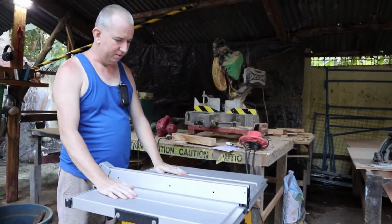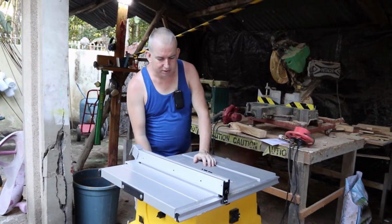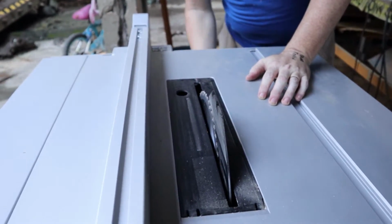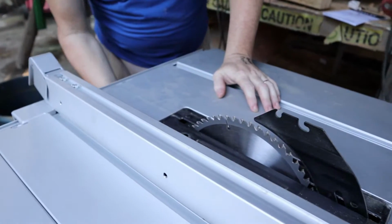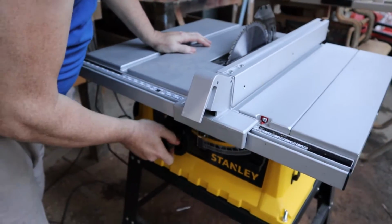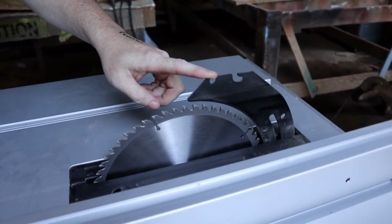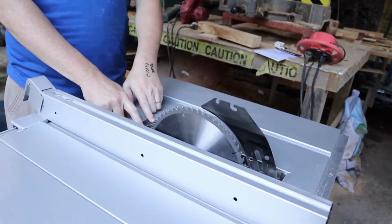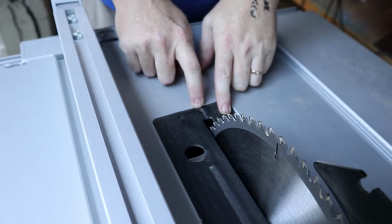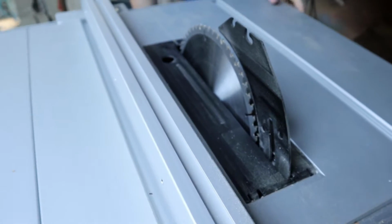This saw here has a nice flat bed. It's like it's made out of aluminum. The saw blade is a 10-inch blade with a 5/8-inch arbor. Comes standard with a riving knife. All saws have them nowadays. To remove the top, to change blades, you have to remove a screw. Remove the screw, pop the top off, take your wrenches, take the blade off, put it back.